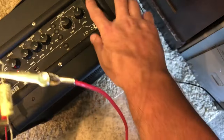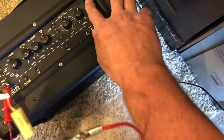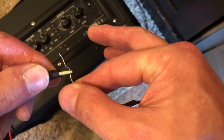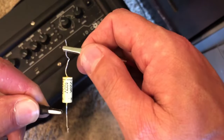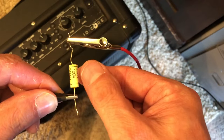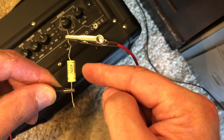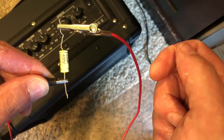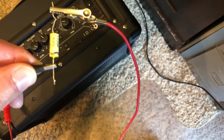Okay, so this one apparently is marked wrong. Let's do this again. I've got the band on this side. We turn it on, touch it — you can hear it. Now by all rights, when we switch these around, when I touch the capacitor itself, the jacketing, it should get louder than what we heard. But that's not what I saw last time around. That is much quieter. So this is a perfect example of not trusting what quality assurance and quality control has done. This band is on the wrong end of the visible coating of the capacitor. It needs to be remarked, if ever used, and oriented properly in your circuit.